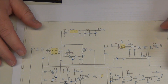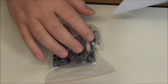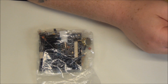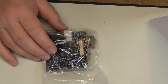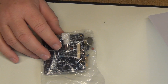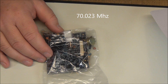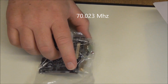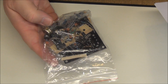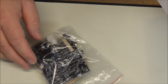This particular kit will run on 12 volts or 9 volts. On 9 volts it's supposed to output 2 watts; on 12 volts you can get 3 watts. The frequency of the transmitter is on kind of an oddball frequency — it's 40 meters, 7.023 MHz. It's a crystal-controlled oscillator; there's a little crystal right in there.